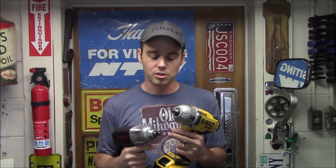Hey everybody, today we're going to be talking about impact wrenches and specifically torque and torque loss. You might think that depending on whatever impact you're using, it has a certain power rating and that's what you're always going to get out of it. But if you use extensions or adapters, you're going to have much less power than if you just use a standard socket.